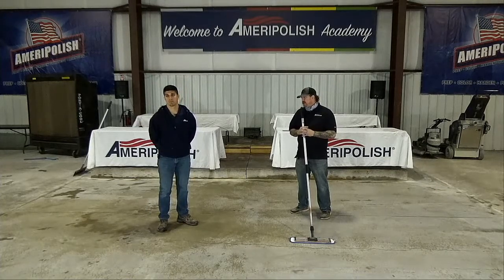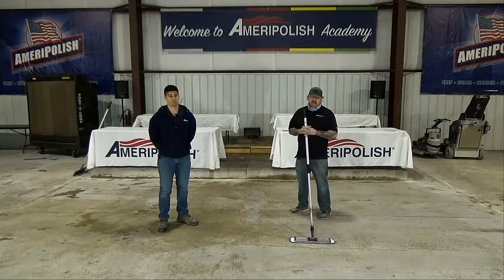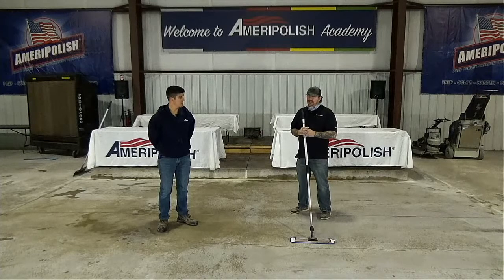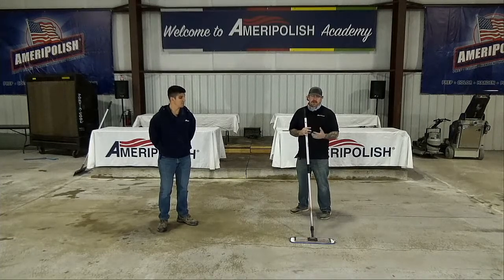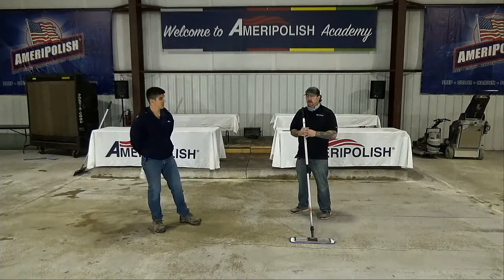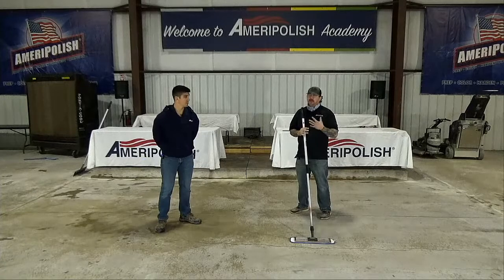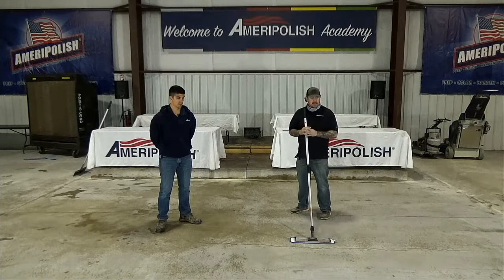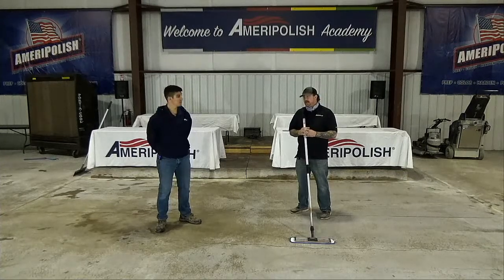You need to make sure you go to the point of rejection. When we say rejection, if you spray the densifier down and it dissipates right away, you need to put more on it. Because if you put SR2 on the floor, it's going to drop right through the floor. You put SP on the floor, it might drop through the floor. So you're not getting the full stain resistance you should be getting. So we want to make sure we put it down to the point of rejection.